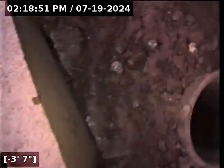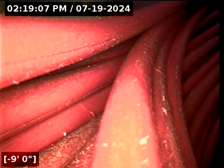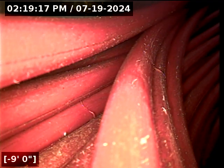So that's not a belly I would typically, on its own, recommend a repair on for the standing water alone. There's just not much there. The bigger stuff I want to take a look at in better lighting is mostly the pipe joints. But from a slope and grade standpoint, nearly the entire line, other than about 2 feet, has good slope and grade to it, so very little standing water to speak of. From a flow standpoint, the line has adequate flow to the main lateral. We'll take a better look, and I'll write that up on the report as far as the structural integrity of those joints. It's just hard to see them right now with the lighting I've got.